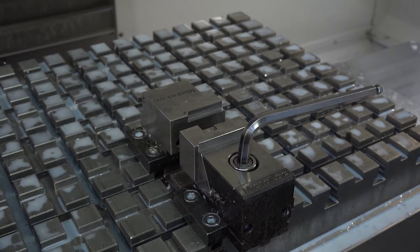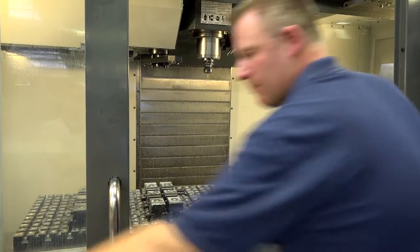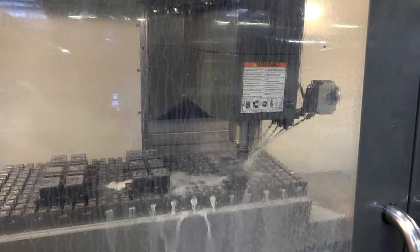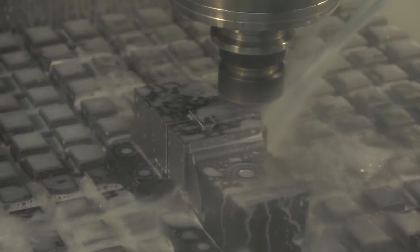You can make it a lot quicker to set up, so going from part to part is quicker. You know it's 75mm because you can see it. And thinking about multiple work holding — if you had lots of components, you can get them in a smaller area. Yes, obviously the smaller the component, the more you can get on the plate itself.